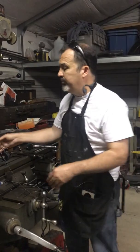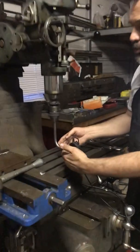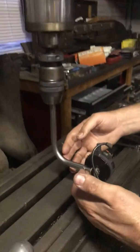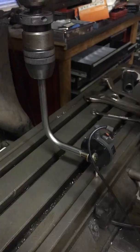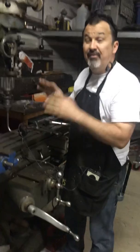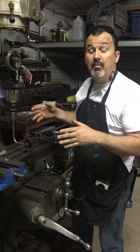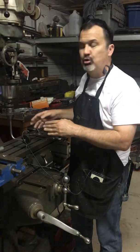So this morning I made this fixture out of half inch tubing. I took a 3/8 bolt, drilled and tapped it at quarter-20 and forced it in there so it mounts my indicator firm. Because the machinist shaft sets that you can put together and clamp and twist different directions — if I bump it, it'll lose all my settings and I have to start over. So this is something rigid that I trust.